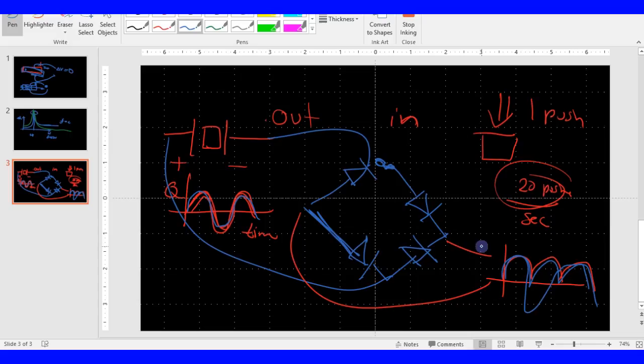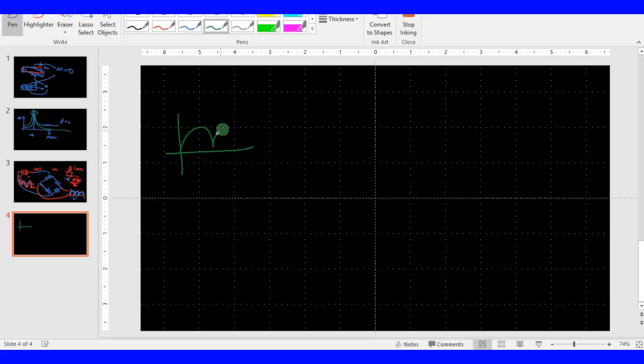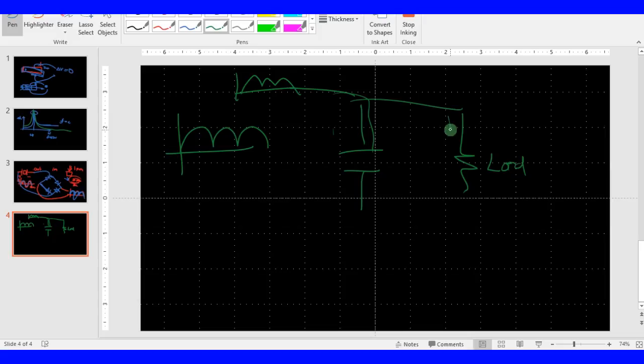However, piezoelectric energy harvesting elements, for obvious reasons, as I mentioned here, we want them to operate in cycles. So we want to convert that. So this is the first step. Now we only have positive voltage, but it's still changing, and we want a sort of constant flow. And the way we get a constant flow is we add a smoothing capacitor. So if you take that bouncing signal and put it over a capacitor, and we hook this to our load, let's say this is our load, or our battery that we're charging, whatever battery symbol there is, it's actually going to end up smoothing this out.